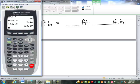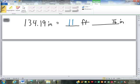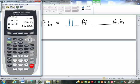Careful. Not multiply, but divide it. We're going to a larger unit, so we have to divide. So 11.1825. So what do we need from that? The 11. So we're going to write down 11 over here. Now what are we going to do on our calculator? We're going to get rid... There you go. We've used the 11, so we're going to subtract 11. So what's left here is the decimal portion. That is decimal feet.